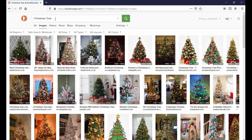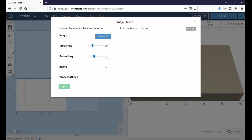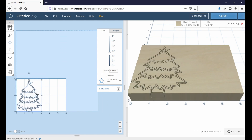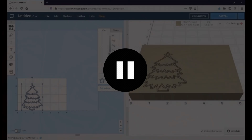You can also find simplified 2D images of objects by adding DXF to your Google search. I'm going to import this image, adjust some settings to make it look right, and position it on my build plate. I will select either cut on perimeter, interior, exterior, or pocket cut, based on whatever looks best for my image. In my case, I'll select cut on shape path. In hindsight, this wasn't the best idea, as the CNC carves every line twice and it doesn't turn out to look very clean in the final product, so I'd advise against doing what I did here.